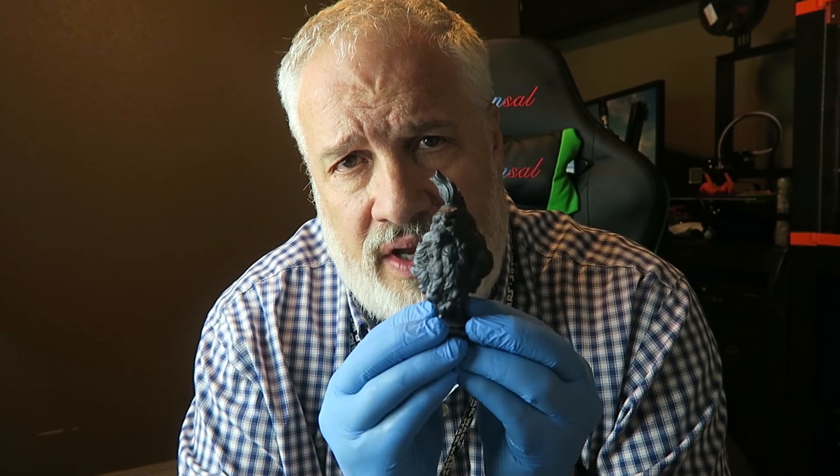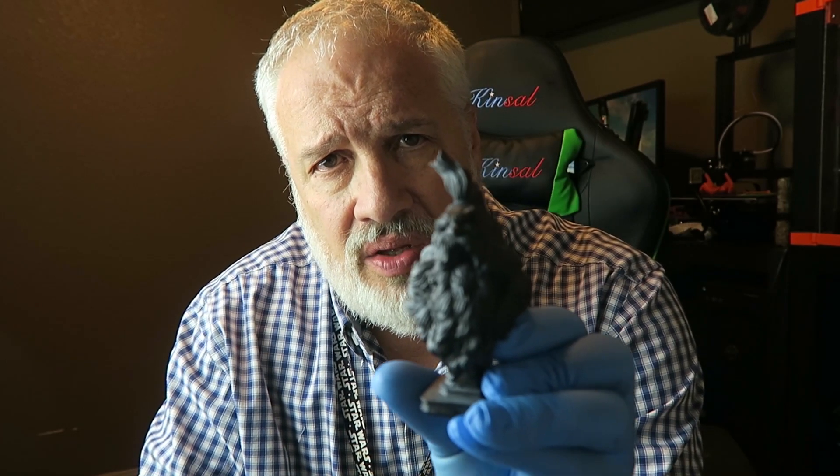In the past I have printed quite a few of these. This one in particular is called the Bearded Yell. I printed him hollow, but if you'll notice on the bottom it's kind of bloated looking there. The problem I had was with resin leaking out of these things. I have tried leaving them in the sun, I've left them in the UV lamp, and still I continue to have issues with these not curing on the inside.